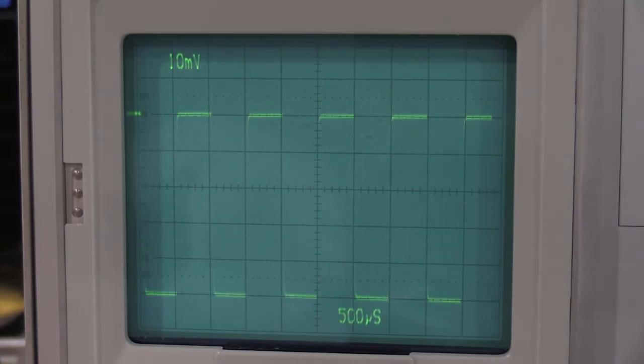The switch was too far forward on the shaft, so the button wasn't going in to make enough contact to actually trigger the function. So it was nothing inconsequential. I just had to adjust the knob further back towards the case. So we are back on to the low frequency compensation of channel 1 and 2.